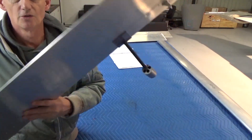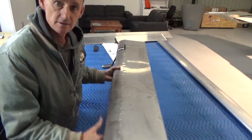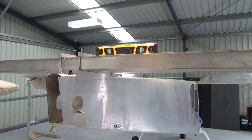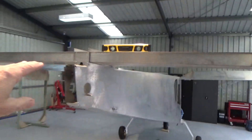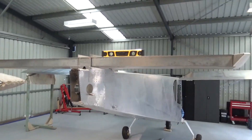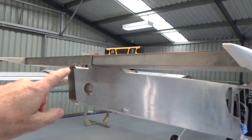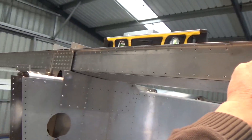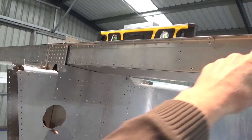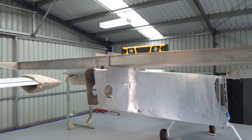With those holes in the back, I'll throw some fishing sinkers in — so a bit more drilling. First thing I'm going to do is just re-zero my horizontal on the horizontal stab. I'll take a zero off the CAG and this has got a slight — the bolts are just in loose at the moment — so it's got about half a degree or so. I'll just get that spot on and tighten the nuts up.